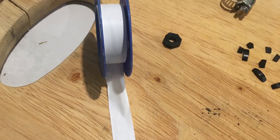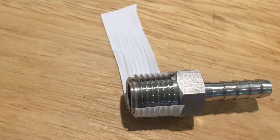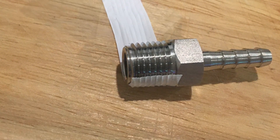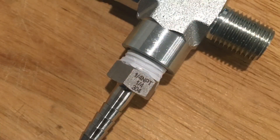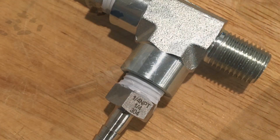You don't want to get any of that Teflon in the path of the water. You wrap it around the thread gently in the direction that you would thread something on there, and you just overlap it slightly, just enough for one wrap, plus whatever overlap you need — just a quarter inch or so. And then you screw it together as tight as you can, and it should be fine. At least it worked out for me.